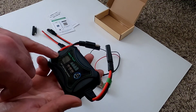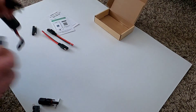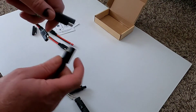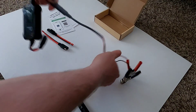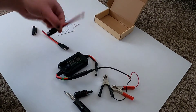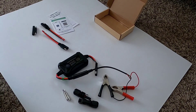The way this works is really simple - one side has a little sun icon that hooks up to the solar panels, and the other side has a battery icon that connects to your battery. I'm taking this SAE connector and linking them together to get a solid connection - and it's just that simple. Now I've got gator clips to hook onto the battery. On the other side, I'll attach MC4 connectors onto the supplied wiring so we can directly hook into the solar panels.